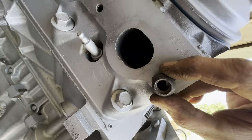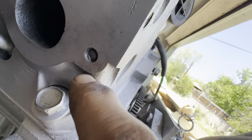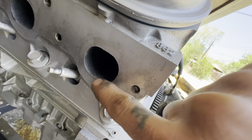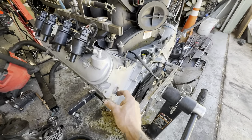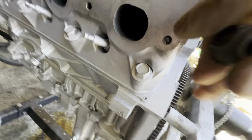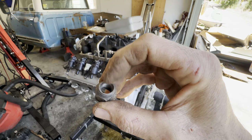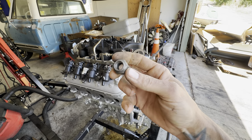However, when the stud is below the surface, the problem is: one, it's harder to line up and know where you're hitting. The aluminum isn't going to be hurt — even if it does get hit, the threads don't start until well below the surface, and even if you mess up the top two or three threads it doesn't matter because those bolts are pretty long. The real issue is the weld ends up being more attracted to the steel around it than to the tiny bolt head way down at the bottom of the hole, and the weld sticks more to the nut than to the stud.